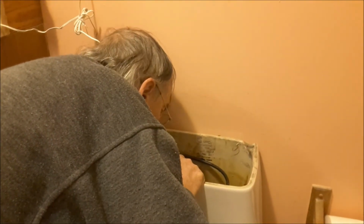And what I found, what was causing mine to stick, was all this grit from my well pump. I had removed the filter temporarily that was in the system, and of course, it gets some light grit that comes up from the well that's 60 feet down. This is South Jersey, by the way. So I'm brushing away all the grit that's around the hole, and it's just going to end up in the toilet. And I'm going to turn on the water again, and I'll use the water to help flush out all the grit all around the perimeter in there.